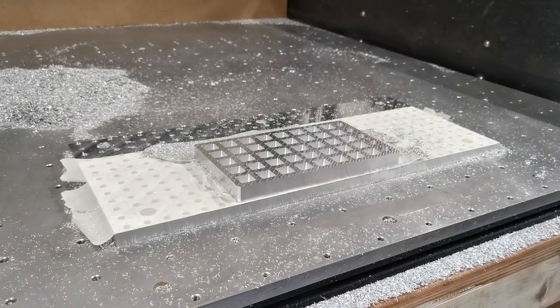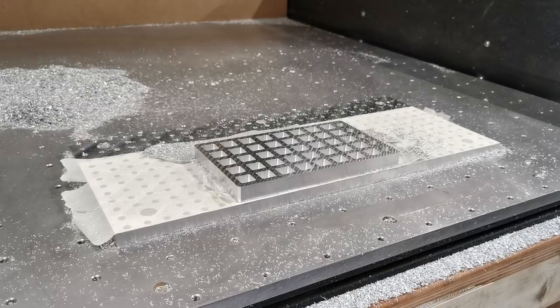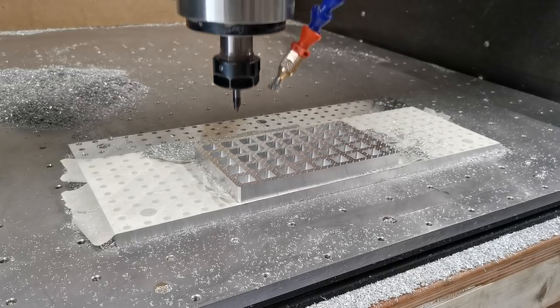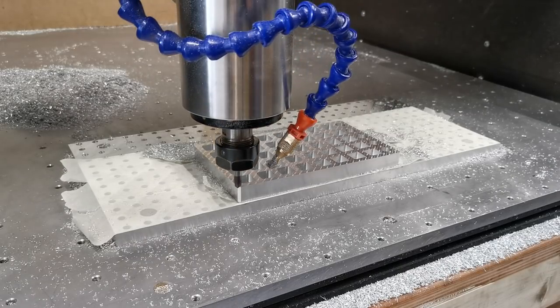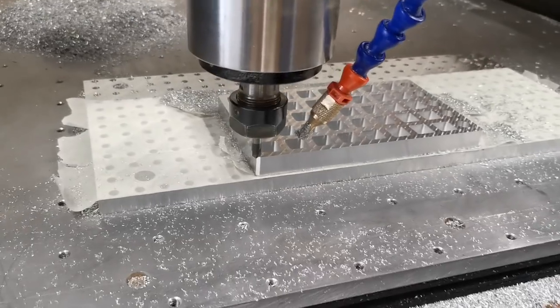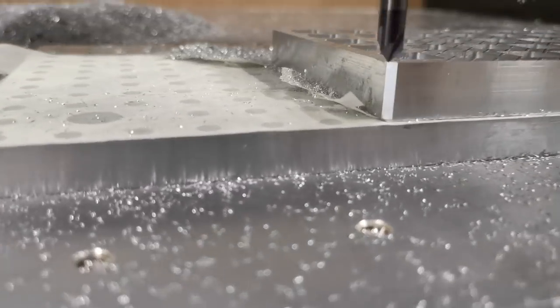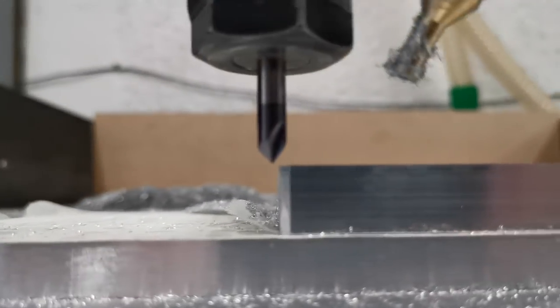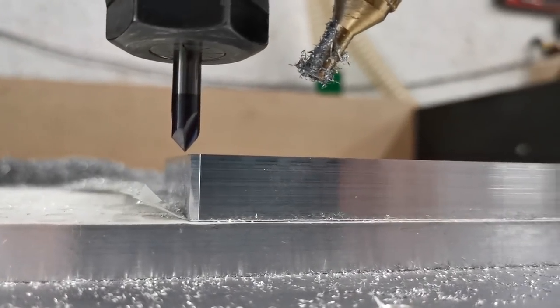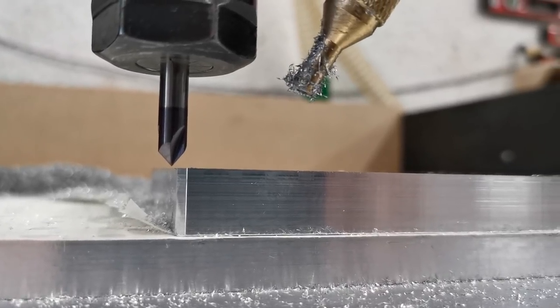At which point he's gone back to home. So now just to show you what's happened — if I click on XYZ it's going to take me to my datum, so that hasn't changed. But my Z offset has. So Z datum, Z offset — and we're going to come out of the mount a second and have a look at that. It's going to be around 0.5mm above, which looks about right from eye. I'll show a photo at the end of this to show you the finish and where he lands. Cheers guys.